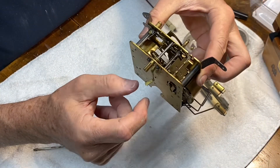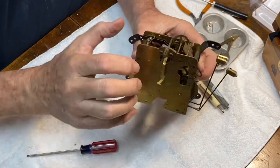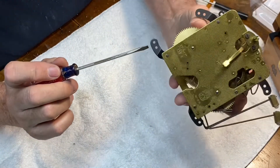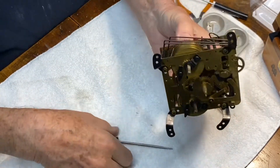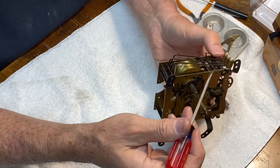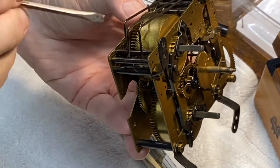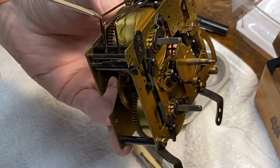When I took it out, it's trying to tick away, so I think the gear train is probably in pretty good shape. It's probably been sitting since 1999 after it was last serviced — it has spider webs on it. I don't see a lot of grease on the gears, but they look very dry so we'll have to lubricate everything. One thing I noticed: there are three hammers and two are tied together. There's a little problem with the spring that returns the single hammer — it's out of place and up against the mainspring barrel.